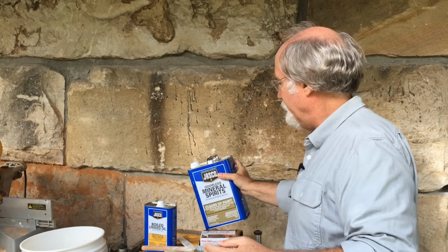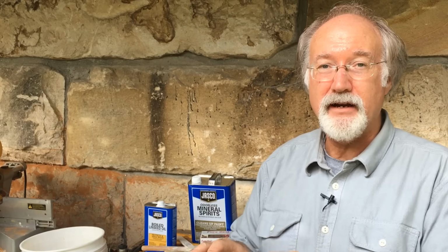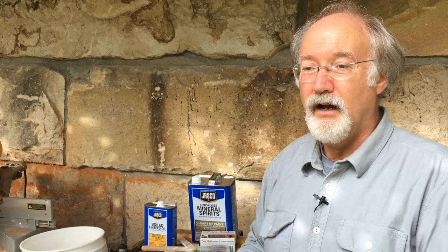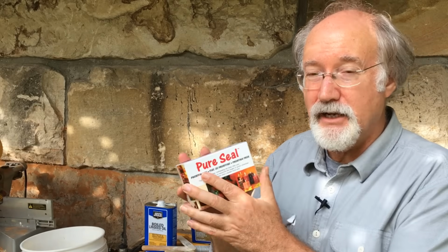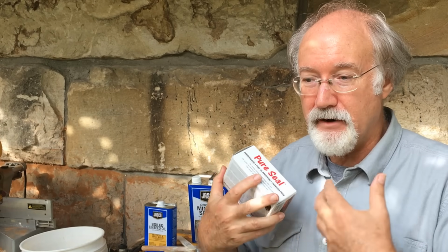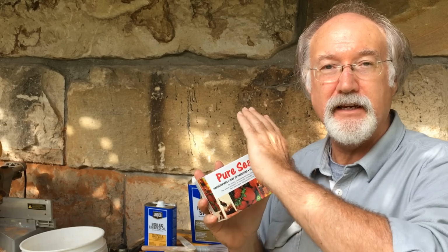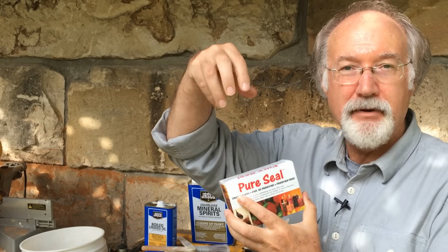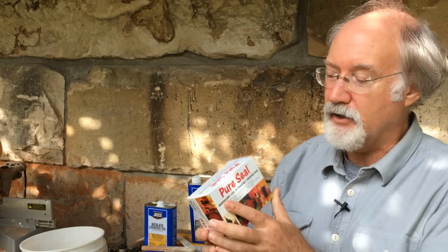And so if we mix the two together, then with just a little bit of the oil, it penetrates into the wood, which is where we want it, and it applies just the right amount to not darken it too much, but it gets that oil into the cells of our wood. And this is just the added extra touch: after everything is penetrated, we end up with a nice waxed finish for the exterior, and we can actually drop beads of water onto our wood and it'll stand up just like a fine wax job on our car.